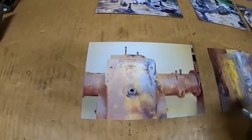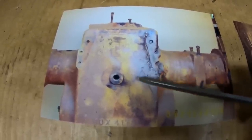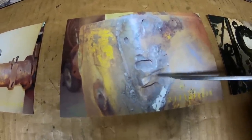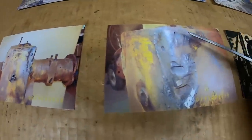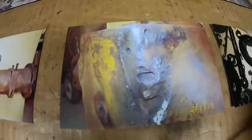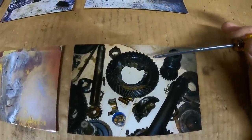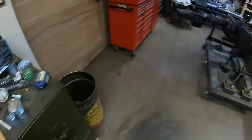We got into it and found horrendous casting damage. A piece had gotten underneath a bull gear in the back end, poked the bottom out of the case, and all of those drawbar welds were from those brackets having run loose for years — it broke out pieces of the casting. You can see the 10X number on there; it's a prototype one-off casting. They just kept gob-welding those brackets on until they finally quit using the poor tractor. This was the differential carrier that came out of it — all 10X prototype pieces — and it had exploded into five different pieces.